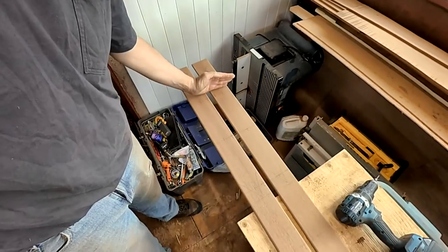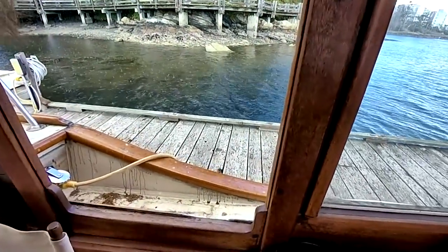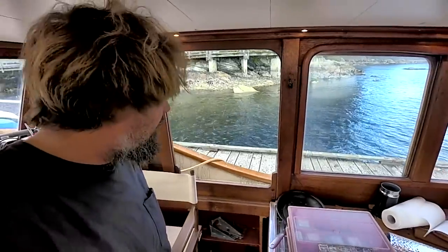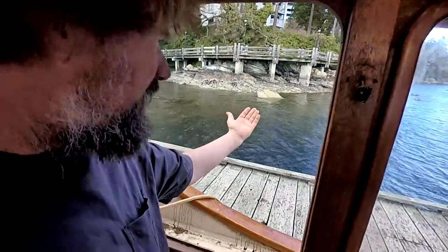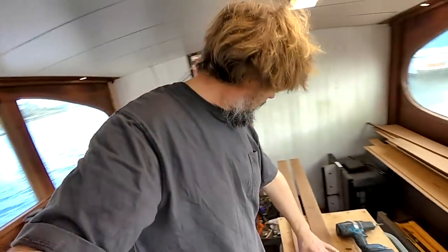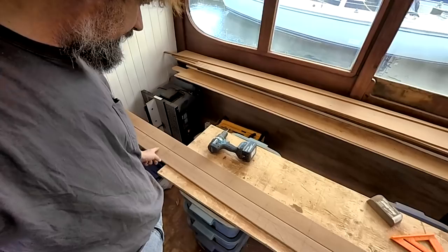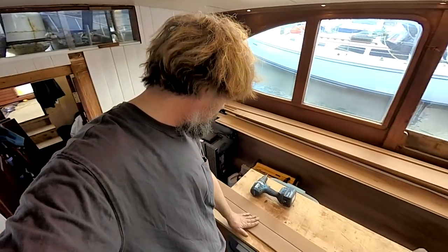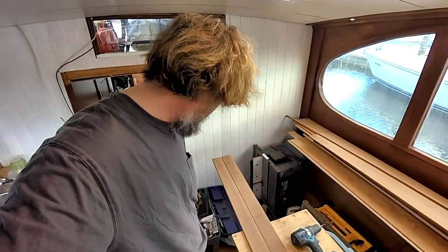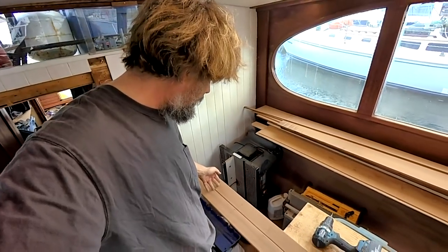The remainder off the end is going to get cut off — I'm not exactly sure where because it's pretty hard to measure around that corner. It's hailing like crazy right now; I was outside trying to get some pictures and got beamed hard enough to be driven in. I'm going to pre-drill the holes but not through the section that's going to be steam bent, trying to minimize the chance of beginning a fracture, since I really want to look after this section of wood.